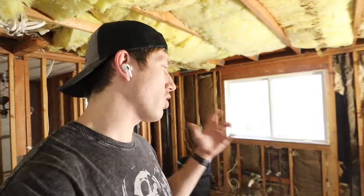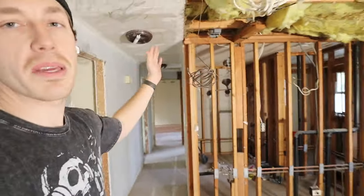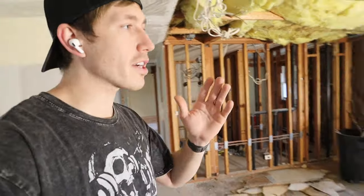I've already pulled all my measurements for this wall. I want two 24-inch cabinets and an 18-inch cabinet, which equals 66 inches. With about a half-inch overhang for the countertops, that brings it to 67 inches. Adding drywall brings the total wall width to 68 inches. I also want it to be even with the walls coming down from the hallway.